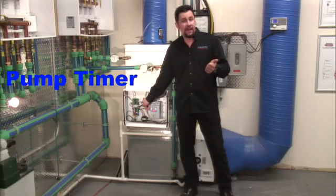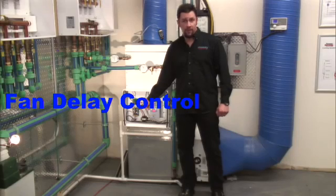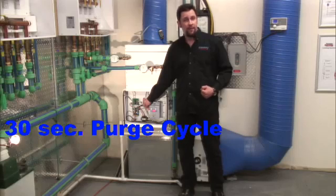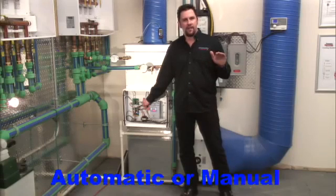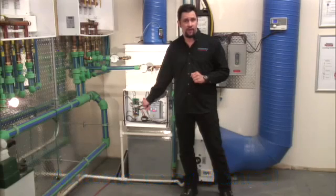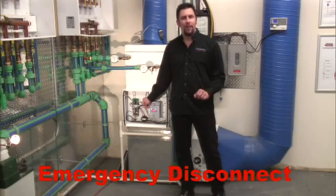In the center of the board features three switches that give you the ability to customize your system. We have the pump timer that can activate your water pump every 24 hours to prevent stagnant water from staying in your system. We have a fan delay control which on a call from the thermostat will delay our fan for 30 seconds in a heating call and 20 seconds in a cooling call, which allows the system to turn on before we start blowing air. There is also a 30 second purge cycle which will keep the fan running even when the thermostat has satisfied. There is a switch that will allow you to go from automatic setting, which is your pressure reactive controller, to a manual setting which will not adjust and react to the static pressure on the system if you do not want that feature. Another new feature is we now have an emergency disconnect on this board which can be hooked up to a fire safety system.